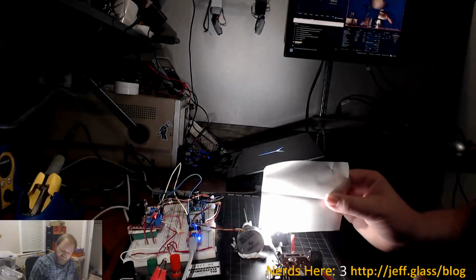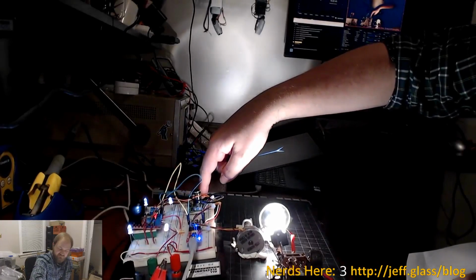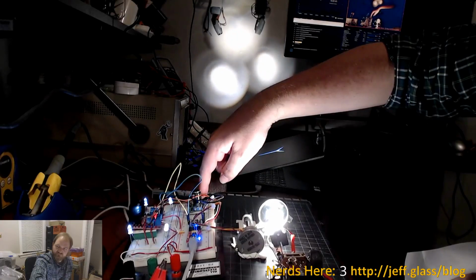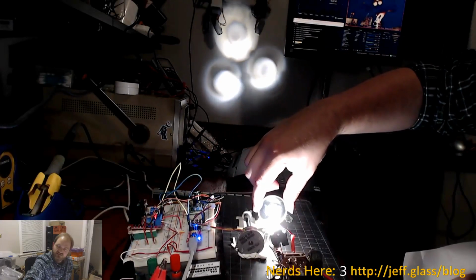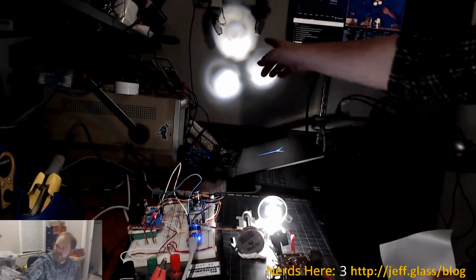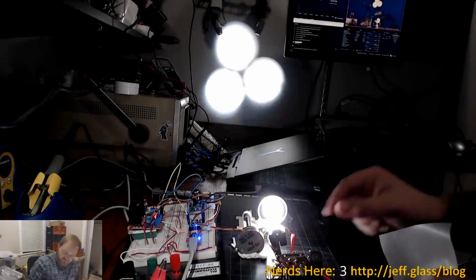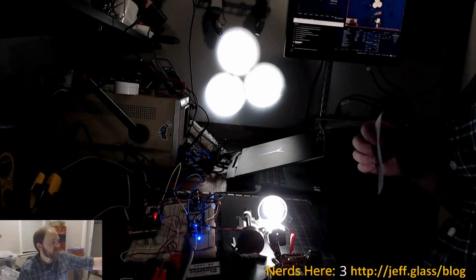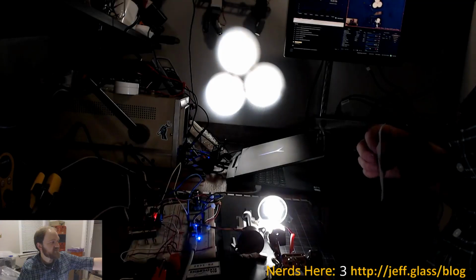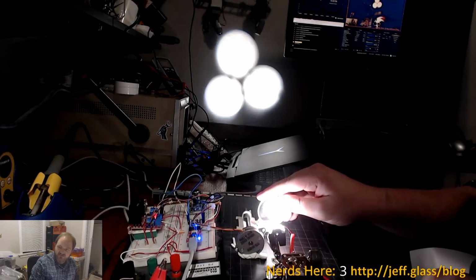Frost flag is kind of interesting. So let's run this back out. It's funny, you can tell just by looking at the diodes on the wall here whether the lens and the emitter are aligned. Because when they are, you get that super sharp, super pretty image of those three diodes, let me turn this down just a little bit, and when they're not aligned, you get fuzz.